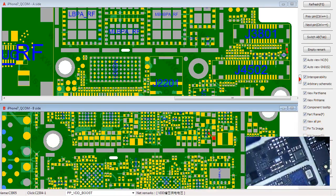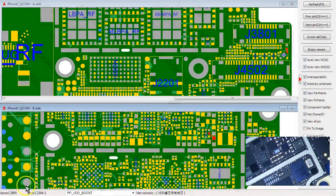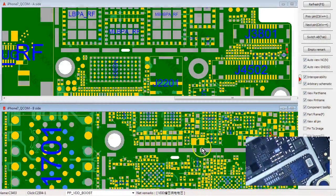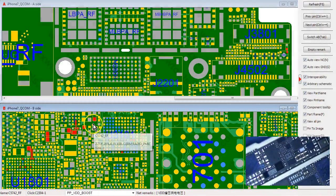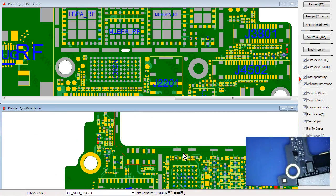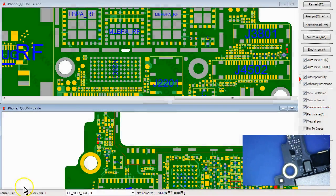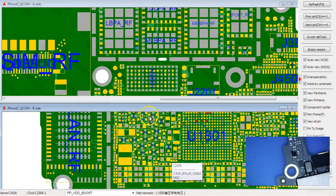The one I'm working on is an Intel baseband board, so that's GSM. ZXW only has the QCOM schematics which are a little more detailed. Looking over the board, things look fine visually. I like to use visual inspection first. Let's go to the top side of the board since there's more components there. Looking at it on the big screen — that looks fine too, nothing wrong there. The Wi-Fi chip area also looks okay.